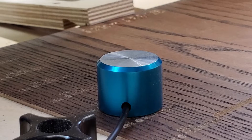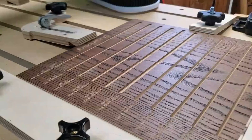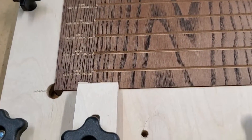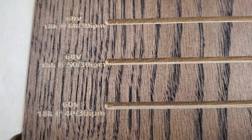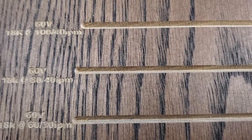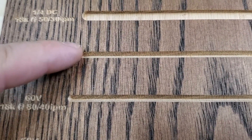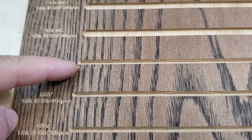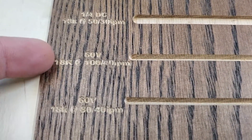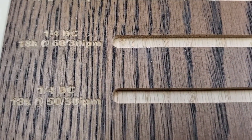Now we're going to set the zero for the Amana spectra-coated 46202-K downcut bit. I sped that setup up just to get it out of your way. As you can see, the cut is fantastic. My cuts ranged from 40 inches a minute all the way up to 100 inches a minute, all at 18,000 RPM, and the cut quality is clean on all of them. The 100 and 80 inches a minute both did very well — I think for normal straight lines that's where I'll go. For V-carve I may slow that down slightly.